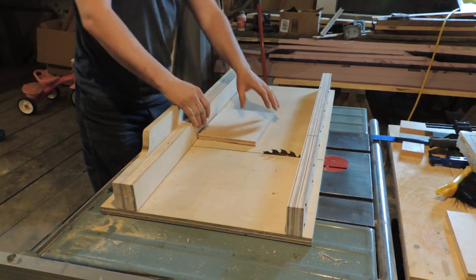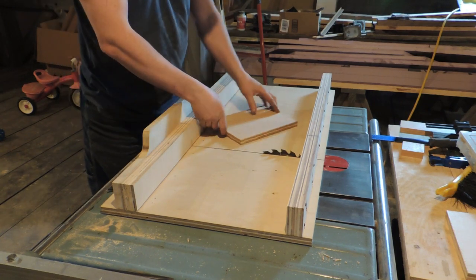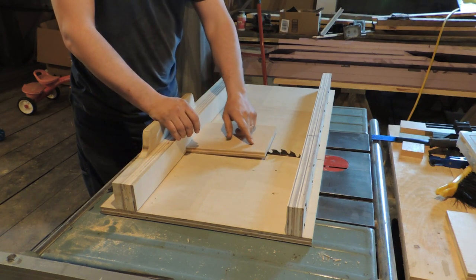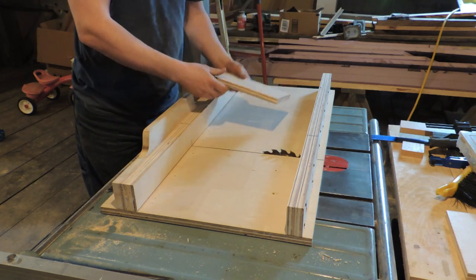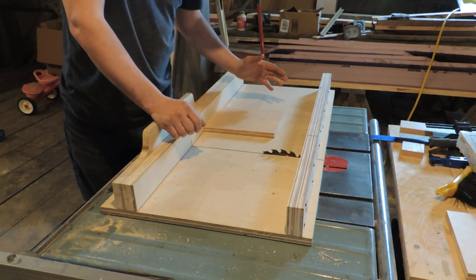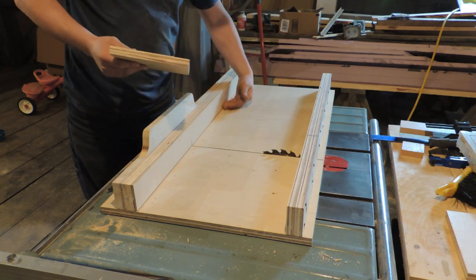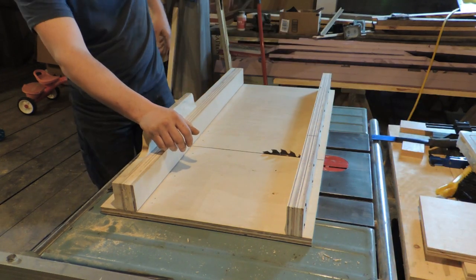Another method you can do to find square with one of these is to make five cuts in a piece — one, two, three, four, and then five. That last piece you cut out, you check it on both ends with a caliper and it'll tell you exactly how far you are off. Then you can use a feeler gauge to adjust it where you need to go. I didn't get that fussy with it because it is as square as it could be right now. I'm happy with it — very happy with it. And at the end of the day, that's what matters.